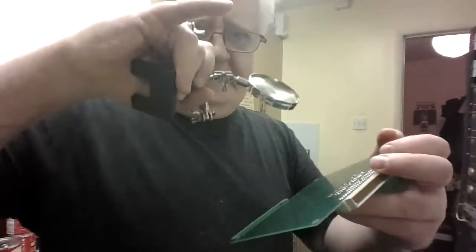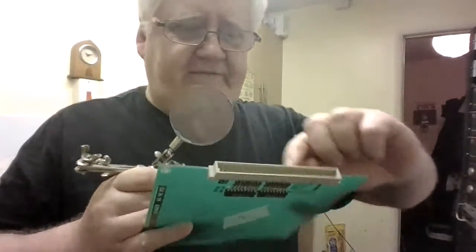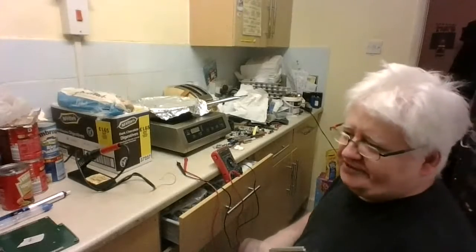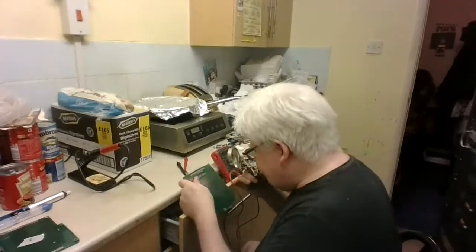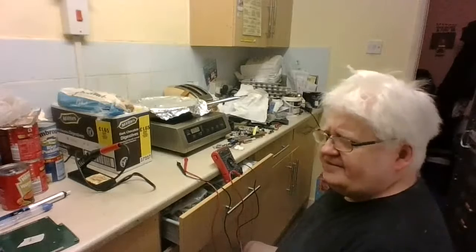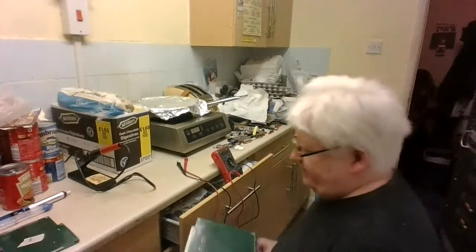So they're little holes, and you get a little bit of ring kind of where the solder connects onto and then holds onto the component, and then you get the little circuit track, and then that networks eventually to these pins, where it's connected into the processor. At the moment it's just flashing like I've got no format, when I know the formats are working, but the indicator for the format is not. It's showing an open circuit, because if no format's actually programmed into the processor, it would in a sense be an open circuit because they're not connected yet to anything. They're not being programmed in.